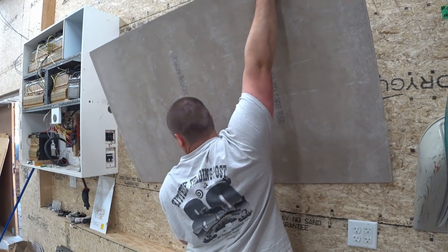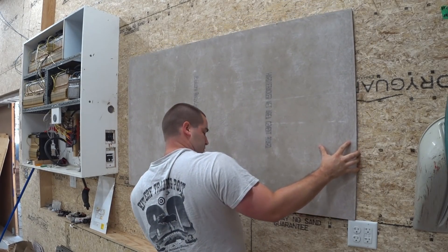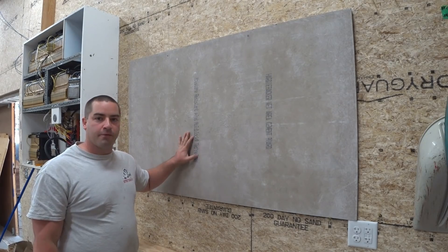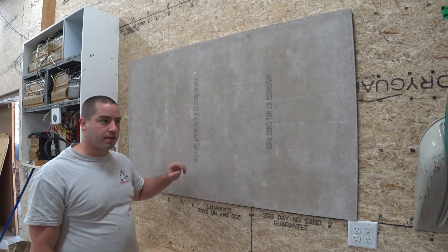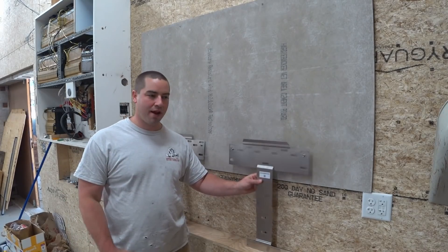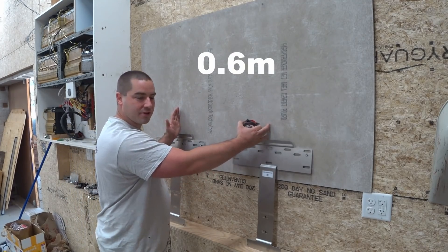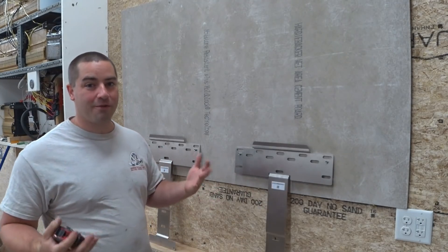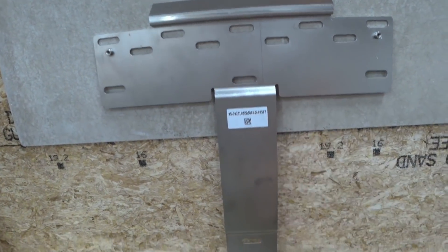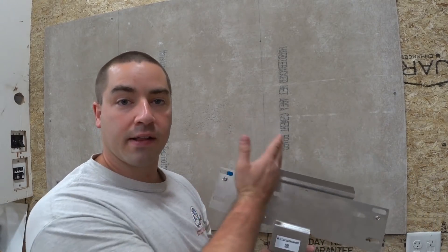Before I brought this in I put a couple of screws down so that when I set this it's level, and I had made a mark over on the left side so I just adjusted it there. Now this is where I'll put the two inverters up. I'm currently adjusting these brackets left and right and measuring them because there's a stud every 24 inches on center in this garage. These inverters are very heavy — about 140 pounds each — so I'd like to grab the studs. So I marked where the studs line up on these brackets, drilled a couple of small holes for the structural screws that line directly up with the studs.